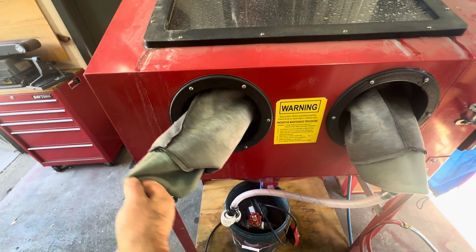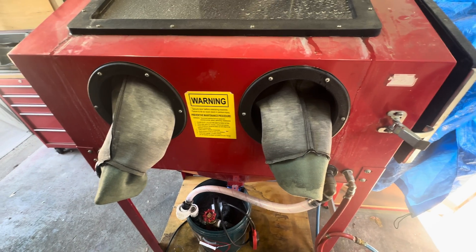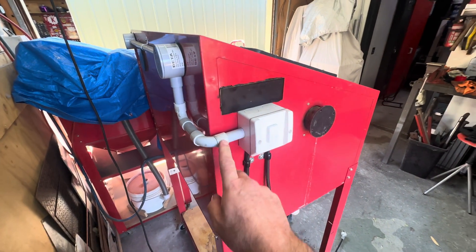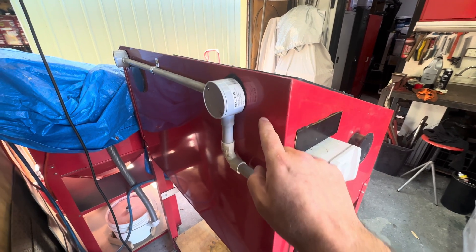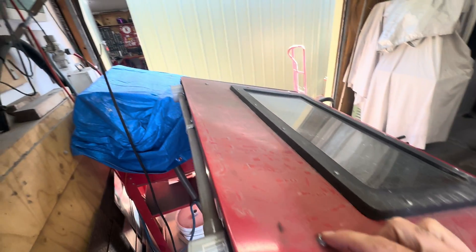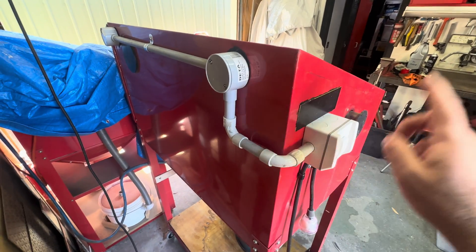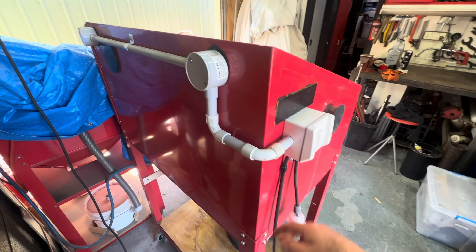These standard gloves are rubbish - they are saturated, so if you can find something better, go ahead. But I just tolerate it and get on with the job. For lighting, this junction box feeds a couple of outdoor LED lights that are inside the cabinet - one in each corner. All I've done is run a line from that switch and wire these in parallel with the switch. So when the switch is on, the lights are on and it's powered to the pump via that.